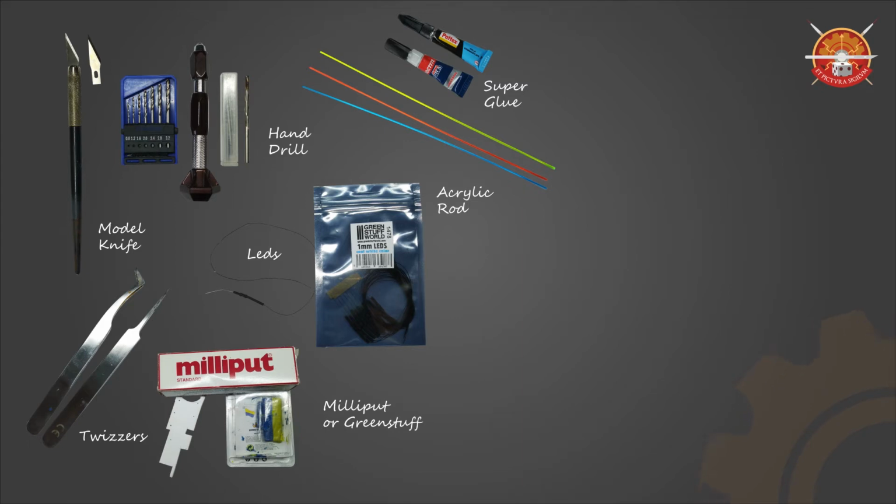We have the conductive paint, which is mandatory to paint the wires that will be cut from the LED. It will provide electricity continuity on the circuit just by painting the wires on your miniature with a brush. Be careful because of the silver particles. I recommend you use a different water pot to rinse your brush. Moreover, if like me you use your saliva to smooth the tip of your brush, try to avoid it this time.